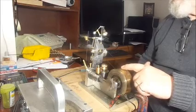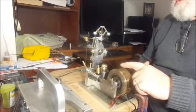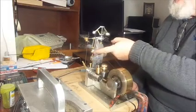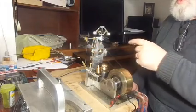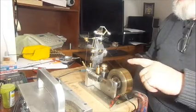And that's why they were called a governor, because they governed the speed that the engine ran at. So that's quite visible there. I can change the speed by dialing this knob right here, changing the tension on these strings. But I'm going to say, for all intents and purposes, this is the governed speed we wanted to achieve.